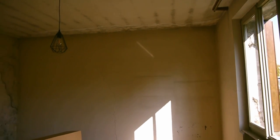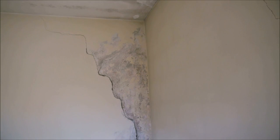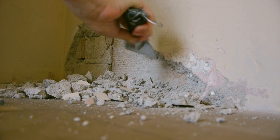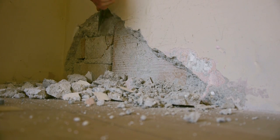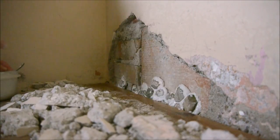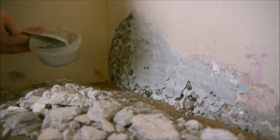This room needed some extra love. For the big crack we made the architect come, and he told us that it was safe to live here. The cement layer of this wall had come loose a bit, so I removed it and also removed some extra loose bits with the hammer. Anything that is still structurally sound will not come loose so easily with a hammer. Then I prepared the wall for some quick drying cement — first a layer with stones to help the cement hold shape while drying, then a layer of just cement, and over that plaster.